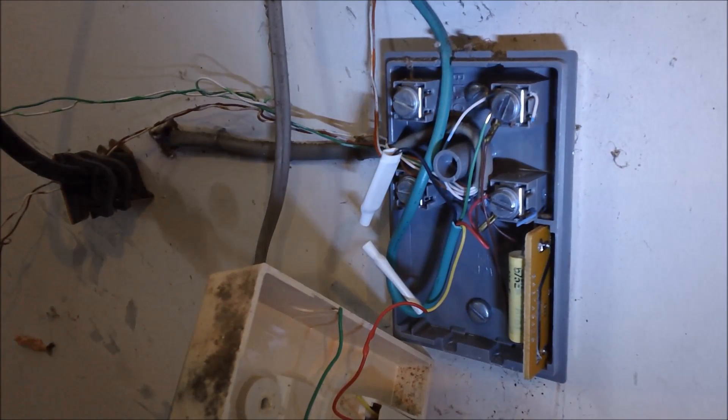I'm going to show you how to fix the real issue. One thing I said before — make sure that this green plug that would usually be up there is unplugged. It's all right to have your main base station or cordless phone plugged in while you're working on it, but please make sure that the green wire is not still connected to the back of your gateway. It's going to be a flat green wire — one will say 'data cable' and one won't be labeled. Make sure it's not plugged into your gateway while you do any work, otherwise you could short circuit and fry your gateway, which will cost you a pretty penny to replace.